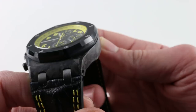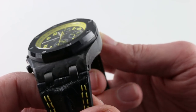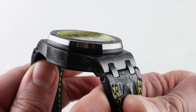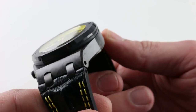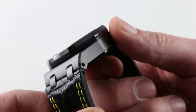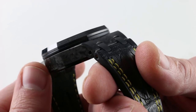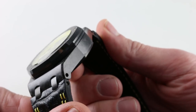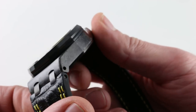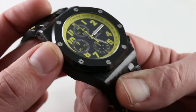When you can find a good angle, you can see the composite structure of the carbon fiber. It doesn't have a grain or a texture. What it does have is the appearance of carbon fibers laid up in a somewhat chaotic fashion in a mold, coated with resin, and then cured at over 450 degrees Fahrenheit to stabilize the material. The forged carbon, unlike a woven carbon fiber, is essentially mashed together, forced into shape under pressure, and then cured so that the material won't distort, gain or lose hardness, nor flake or decompose. It's very light, and it does a good job of hiding abrasions and scratches.